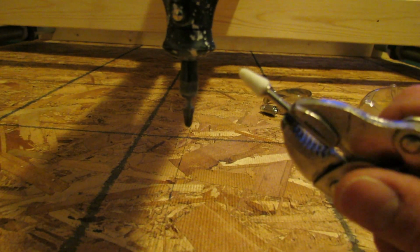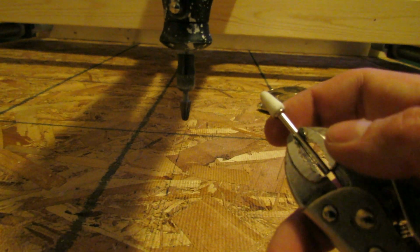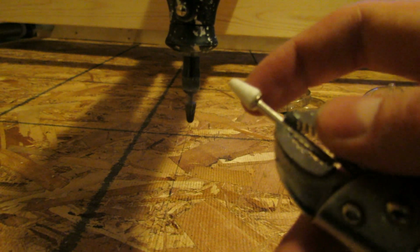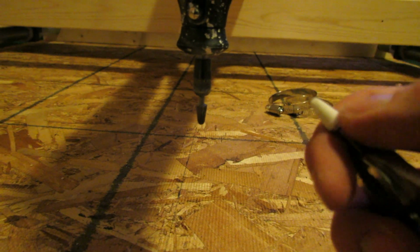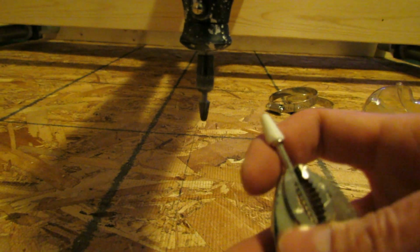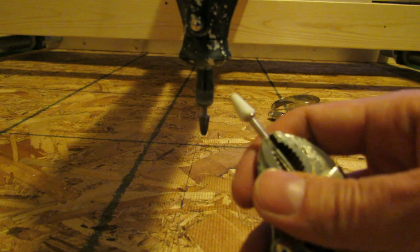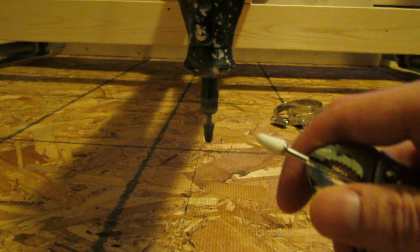So, I knew that was going to happen. I had to basically shave everything. It was a block about yay big, and I had to shave all that down and cut it. I tried breaking them out, but the smooth cast would break as well. This smooth cast cures totally to a really hard plastic, but for several hours it stays flexible, and I thought that would aid in getting it out. I definitely didn't think it would break, but it broke.